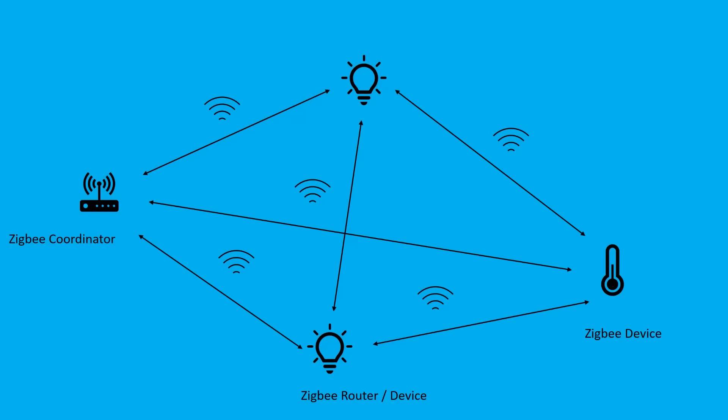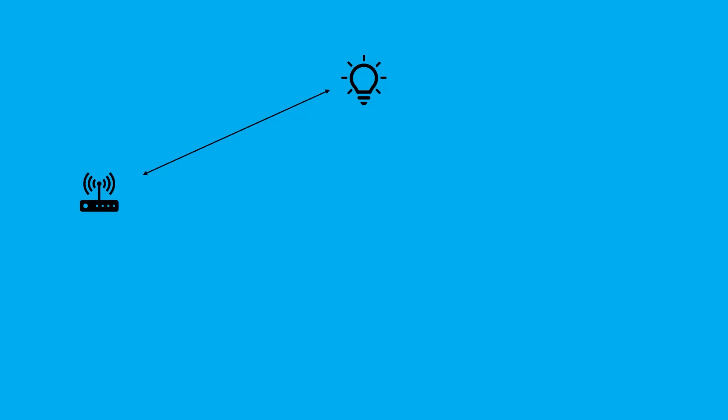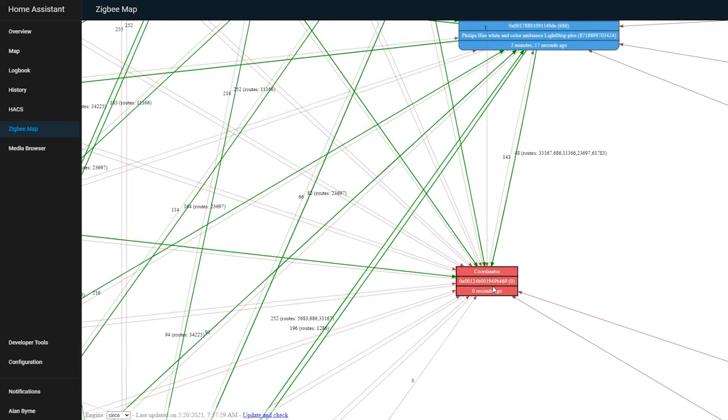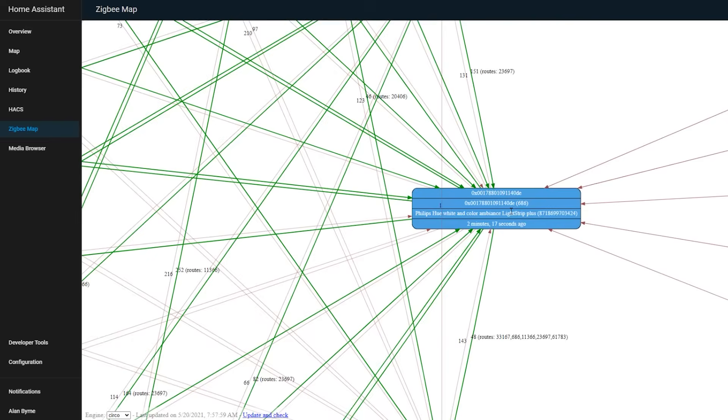The third improvement I made to improve my Zigbee network reliability and performance is to create a solid mesh network. Permanently hardwired Zigbee devices, such as light bulbs and smart switches, have the ability to act as Zigbee routers, which can pass Zigbee signals through them. That means if you pair a battery-powered sensor near a Zigbee light bulb, the light bulb can pass that signal onwards to your USB coordinator. It could also pass it to another router, which means you can extend your network well beyond the distance limitations of your USB coordinator if you have a big house or thick walls. Routers also allow you to add more devices to your network than your coordinator can support by default, because each device is talking to a router rather than the main coordinator.